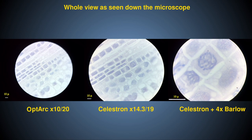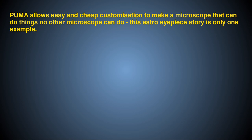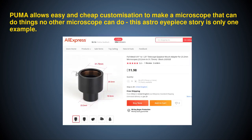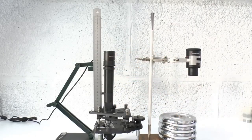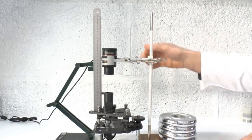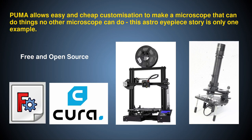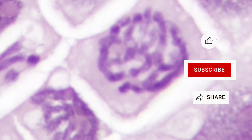Such magnification can make features easier to see by eye during live viewing down the scope, as opposed to image recordings. As far as I know there are no commercially available microscopes that accept 1.25 inch eyepieces. Yes, you can buy cheap 23.2mm to 1.25 inch mechanical adapters like this one, but I hope this video and the last one has shown you why simply changing the diameter of a tube is not sufficient for proper use of a 1.25 inch astronomical eyepiece in microscopy — so such adapters are of limited use. I hope these videos have also given you an idea of the power and usefulness of Puma as a fully customizable high quality biological microscope, and even more so one that is open source and rapidly modifiable with free software and low-cost 3D printing. Please remember to like, comment and share this video to support the open source Puma microscopy project. Thanks for watching.